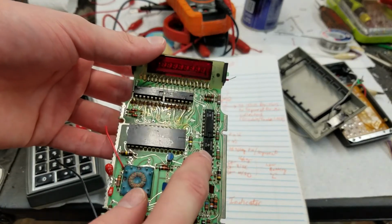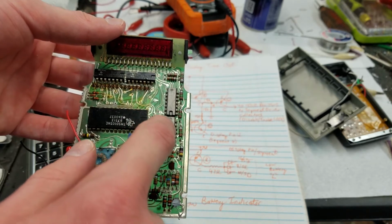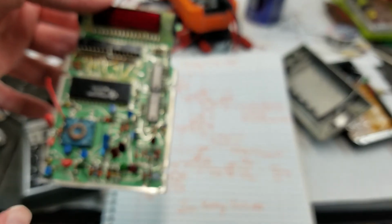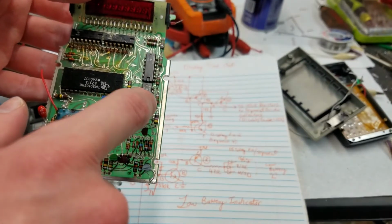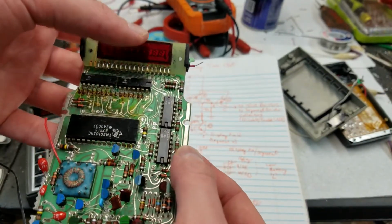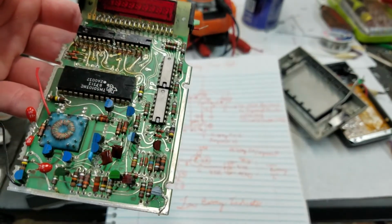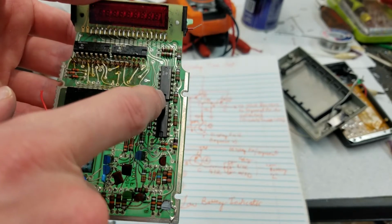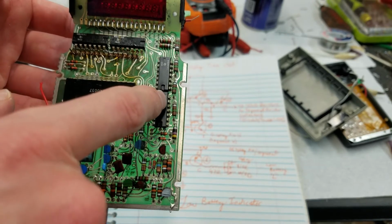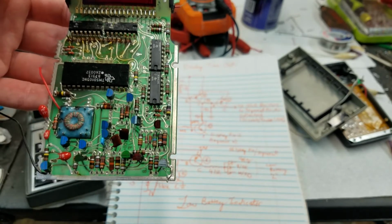All of these chips here. The way that these chips are is they have a collector input for each individual digit, and I'm guessing so you can resistor limit each LED individually, which is what they've done here. So each LED segment gets its own individual 150 ohm resistor, which are all these guys here. So these chips, for every segment rather, they have an input, an output, and the collector. The collector is connected to these resistors, and then these resistors go directly to positive 7 volts.